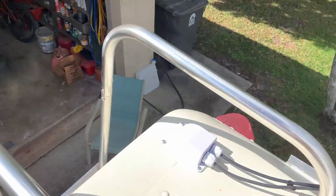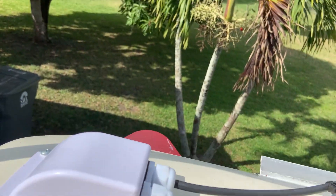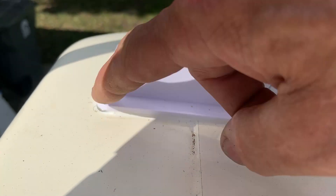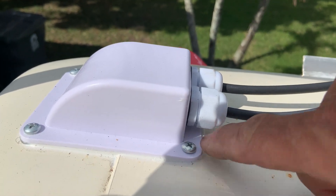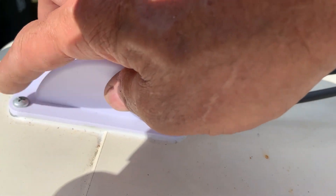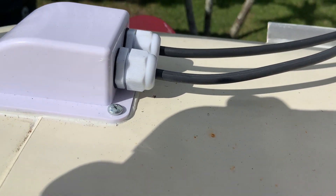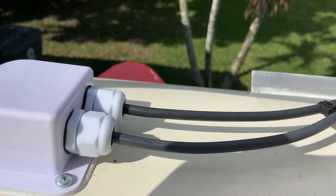Here's how I did this, if I didn't catch it on the previous video. The surfaces are uneven here by about a sixteenth. So I use washers up underneath there on the back two screws, just so this would sit level and not try to bend this and crack it. This is Gorilla Construction Adhesive, cleaned up with mineral spirits and paper towels. I put the Gorilla Construction Adhesive underneath the washer so that it's on both sides — it's super well sealed. I've got no concerns with that. I need to get some pliers up here and give this a little more tightness — can't grip it better with my little stubby fingers. But those are going to be watertight. Airtight, probably.